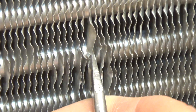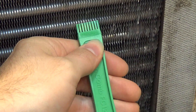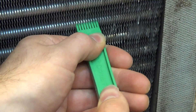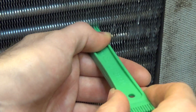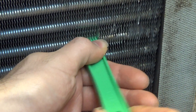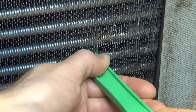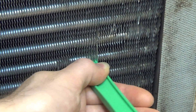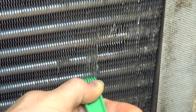Alright, so now that this is somewhat as it should be, I'm going to get the comb going. What I'm going to do is insert it above the damage in a good spot — right here is pretty good — and stick it in all the way. Then I'm going to rock it like this and slowly push it down. Like any other tool, you want this to do the work — you don't want to just force it down because you'll tear the coil. Apply some force but kind of let it flow through the coil. If it gets hung up, just do more of the sideways motion.